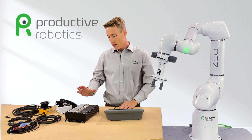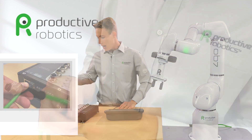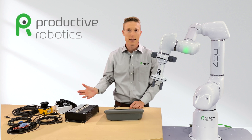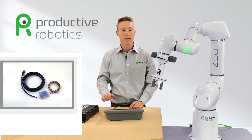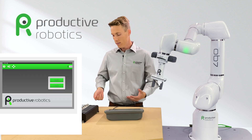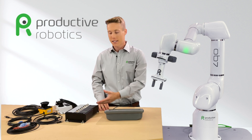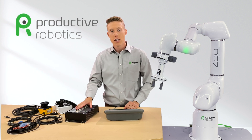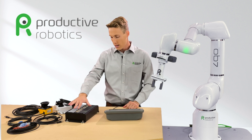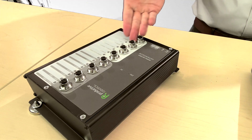Straight up, GEI 2 is designed as a plug-and-play unit with standard M12 connectors. It's the heart of our complete system of ready-to-go sensors and equipment. Everything is designed to work together effortlessly and plug right in. It's fast, simple, and effective. The GEI 2 features 24-volt operation and two optional 5-volt outputs with eight assignable analog digital inputs and eight outputs.